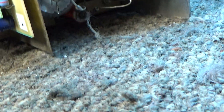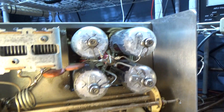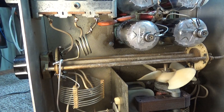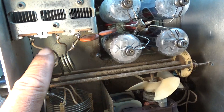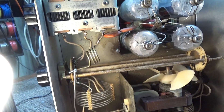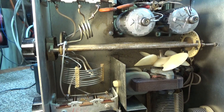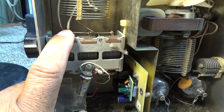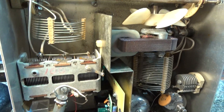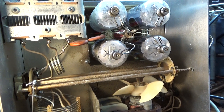This amp has been 10-meter modded but left all the other components in it. I always talk about the four turns - that's your four turns for 10 meters. Normally the signal goes through the band switch and switches all the wires, caps, and components. With the 10-meter mod all that stuff is left in and connected, but there's a jumper wire from the 10-meter coil over to the load and output on the other side of the load cap. If you don't want straight 10 meters, just cut that jumper.